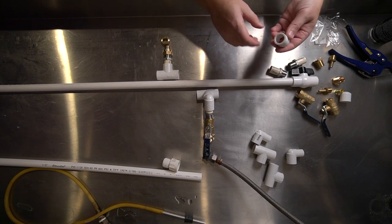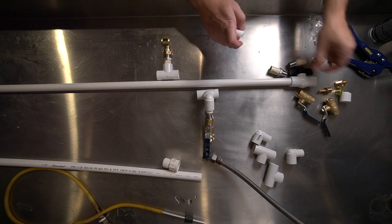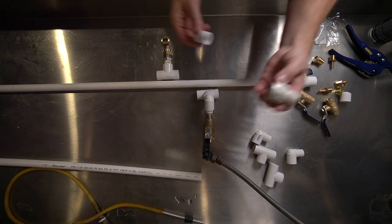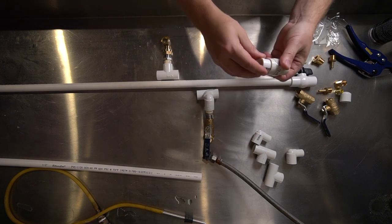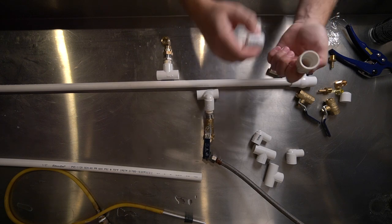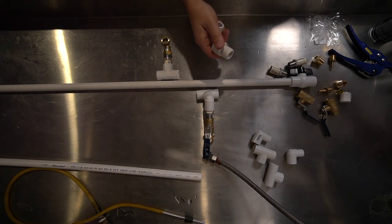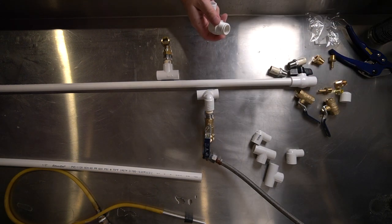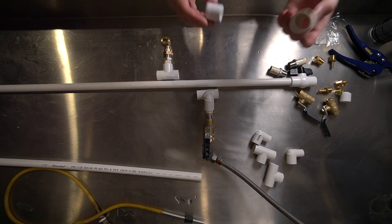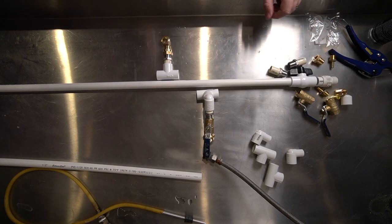That will go to a small piece of pipe. So I'll have just another piece of pipe, which goes to this thing. And this fits into here, like this. Because this is actually changing it from half inch to 3/4 inch. So this is a garden hose connector, and it will connect to, you can't see it, it's off too far off camera, the garden hose connector for the vertical print washer. So that will then connect there, and I can turn that off and on.